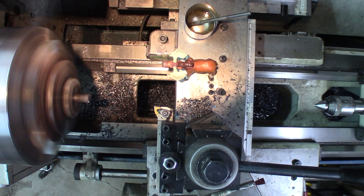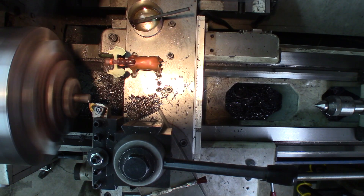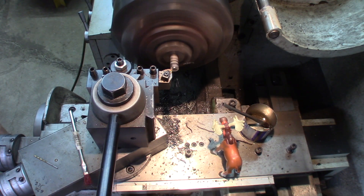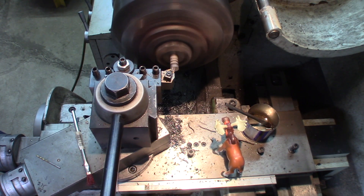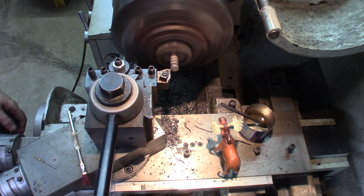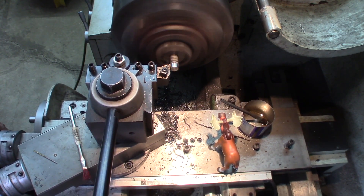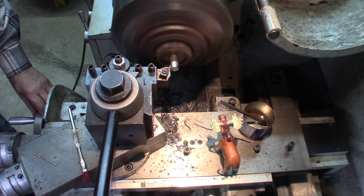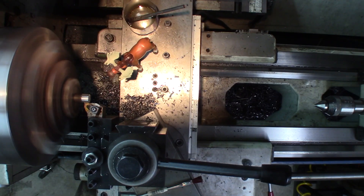Now we're doing the facing on the first side. I'm going to make myself a little shoulder. I'm hand cranking the handles on this. I'm going to go for Z zero and I want to give 580 thousandths here. That's going to make me a shoulder so the bar won't slip in the chuck. Sometimes it's easier to make something slip in this.